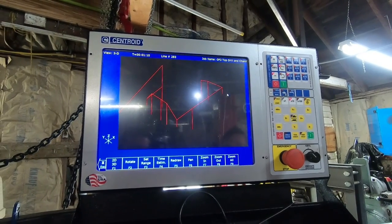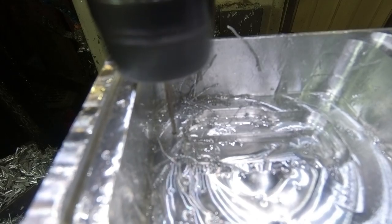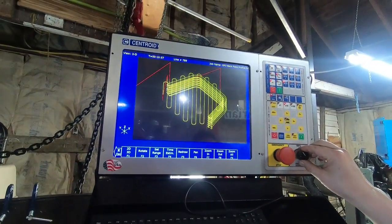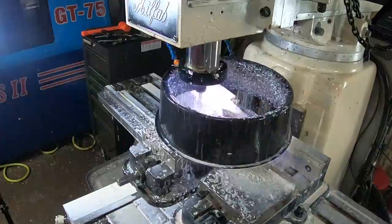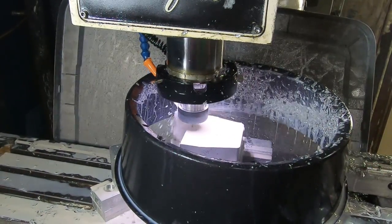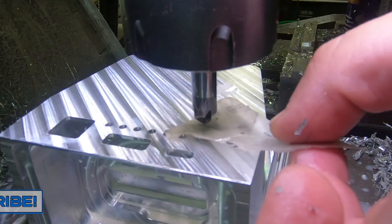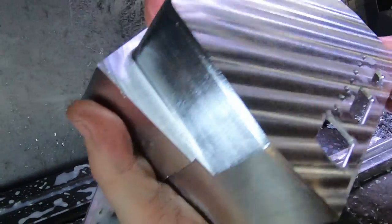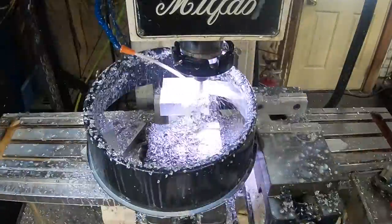The pocket's done now, it's time to do drilling and chamfering. Then on to the back to do our facing. Facing churned out. Next part is really different — here's our contour for the back, and here's the pockets. Here's how it looks — that 45-degree angle is awesome, I love it. Here's a nice deep chamfer. Now we're on to the front side and we're machining out the rest of the material to bring it down to size.